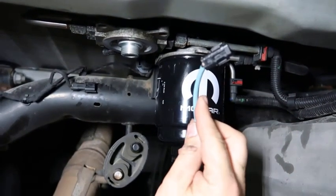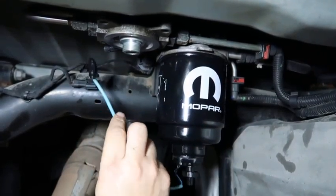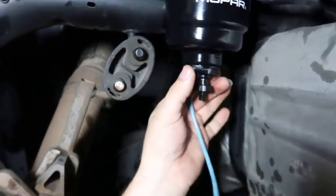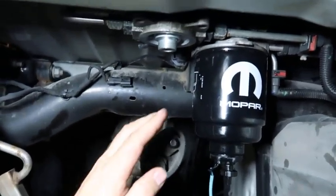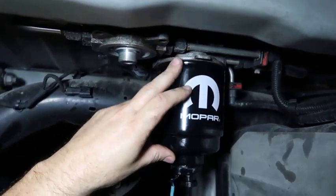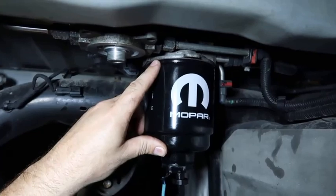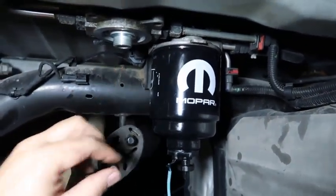Then there's this connector — just plug it back in. That's all it is. Put your o-ring around the sensor, tighten it back up just snug, and you'll have your new o-ring up at the top. Make sure your old o-ring comes off — just like an oil filter, make sure it doesn't stay up on the mating surface of the housing. You don't want to double-gasket your filter.